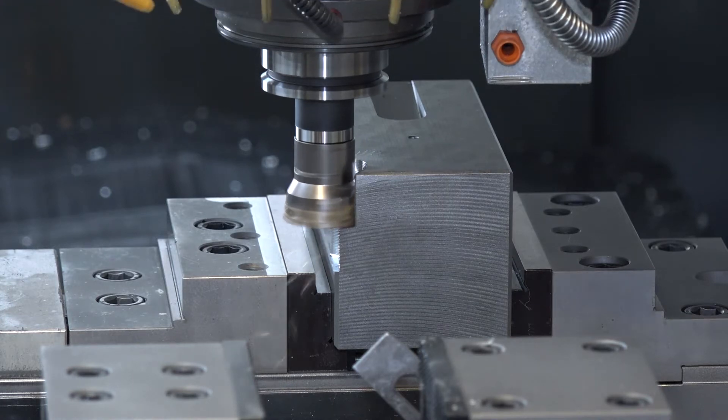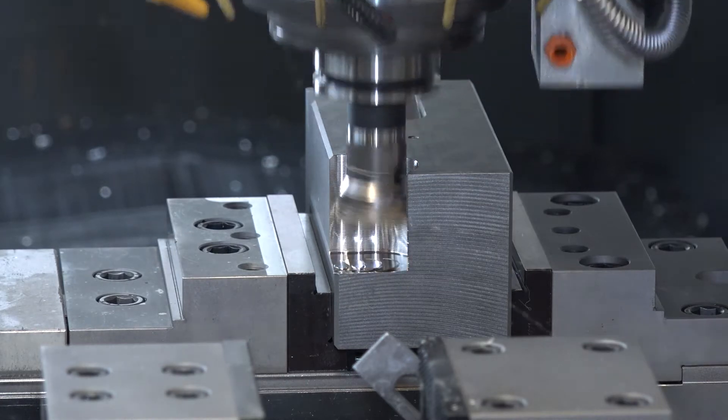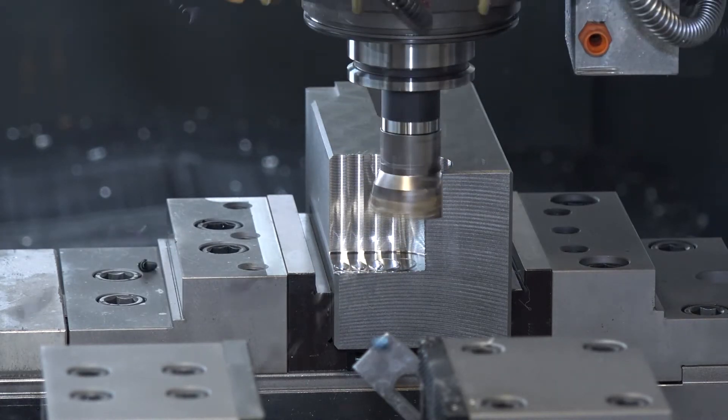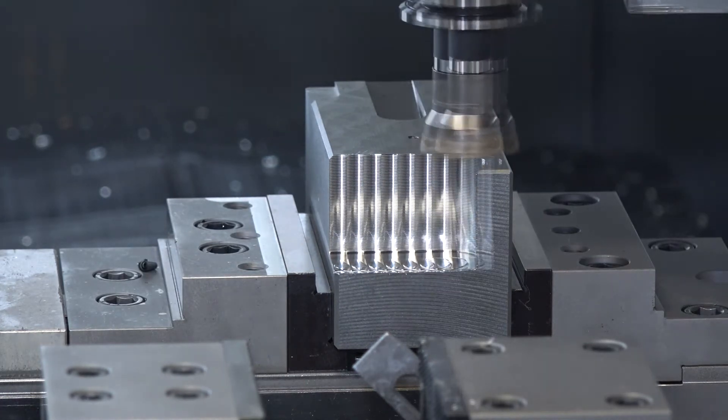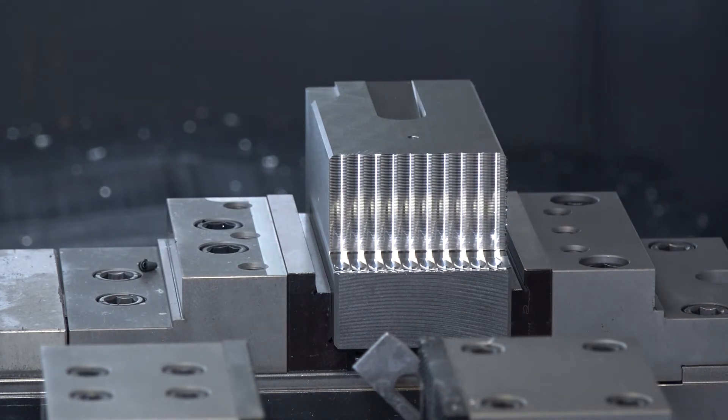Steve: The insert is a drilling insert. As anybody knows, a drilling insert is a very bad application — it's in a hole with loads of swarf — but it loves milling. Mark: So have you devised this milling cutter around the actual insert? Steve: Absolutely, and we still continue to develop this tool around the insert with more options for customers as we go forward.